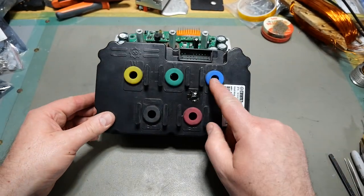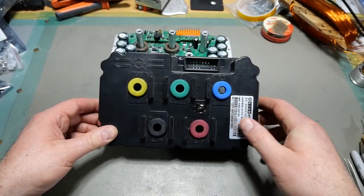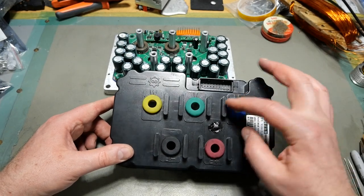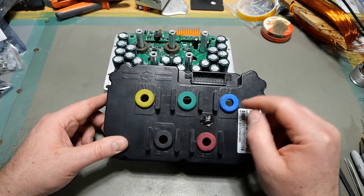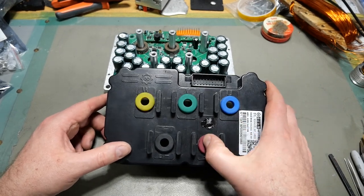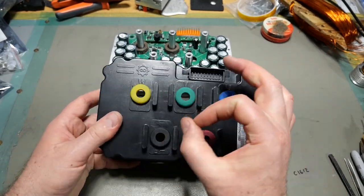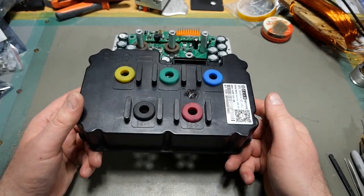On the top cover, these silicone grommets are just kind of pressed into place around the aluminum studs. You put the ABS plastic shell in place and then press those around them. I've put silicone underneath all these things so they're basically glued down. There was a sticker over top of this hole that I pulled off because it was interfering with the battery plus silicone grommet. I peeled it off, filled the hole with more silicone. They come with a little round sticker over that spot — that's where they pour in the potting once the controller is assembled.